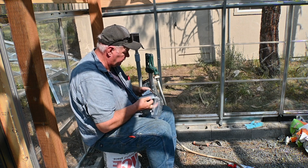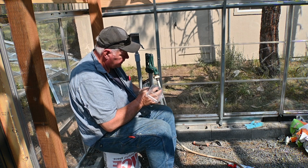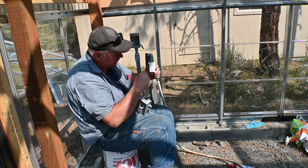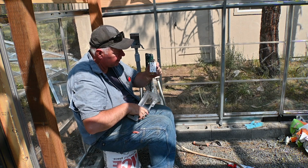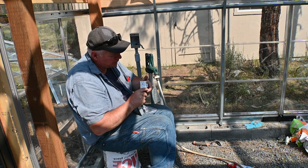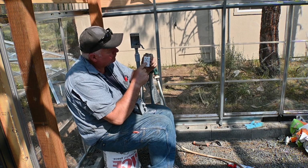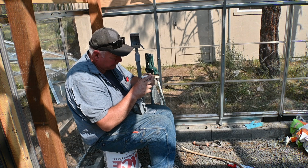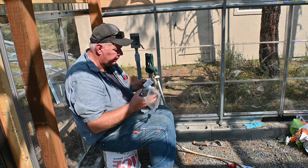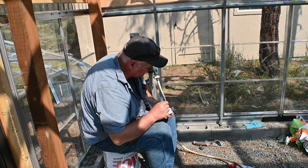Receptacle goes in first. Yeah. Ground down. Ground down. Smiley. Make a smiley face. You make a smiley face out of it, you always know the ground's pointing the right direction. Turn it upside down, no smiley face. Easier smiley face. The ground goes down. Okay, so I'll probably put that in there, and then put this on there and then screw it together. Okay, so, but for right now.